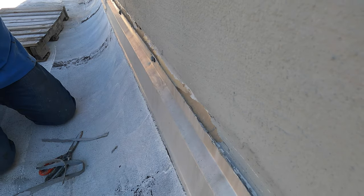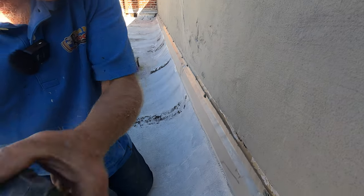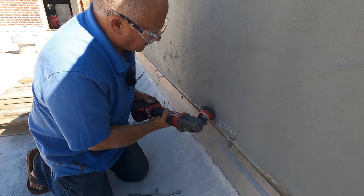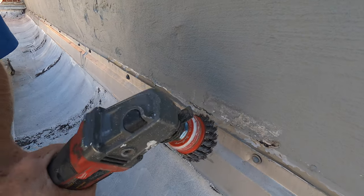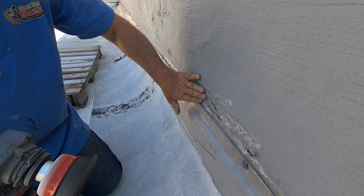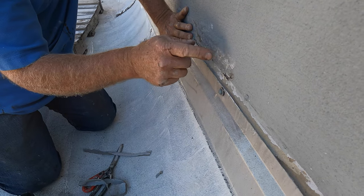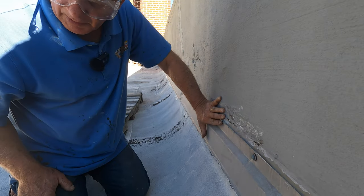So what you need to do is remove the paint right above the caulking line about two inches. You can tell the paint sticks very well to the wall — I can barely get it off. It doesn't come off, so that's good news. You don't need to remove the paint if it sticks to the wall that well. It's very good paint and it sticks to the wall, but it doesn't stick to caulking, and that's where the leak is going to come — these cracks here. So it's very easy to repair.